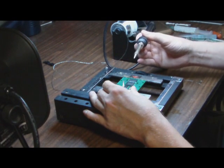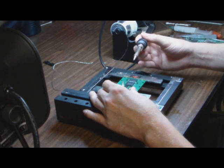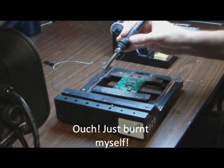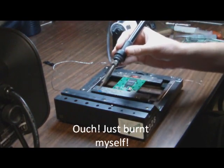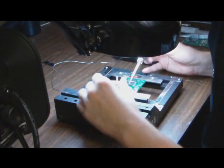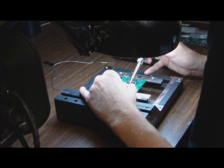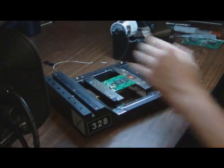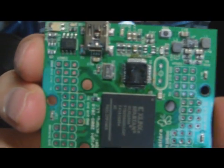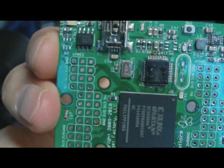One thing I'm doing that I'm not really talking about — you can also use a drag technique while using the solder wick to clean this up. You start at one edge of the pins and use your soldering iron to drag the solder from one side to the other; it'll collect it all on one side and then you just use your solder wick to wick it all up. Those pins look like they're ready to go and there are no solder bridges anymore, so it's pretty easy to clean that up.